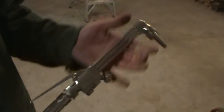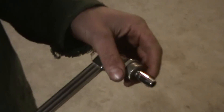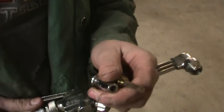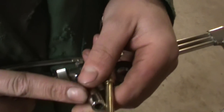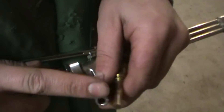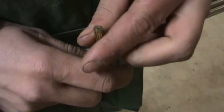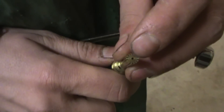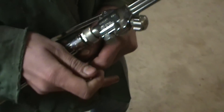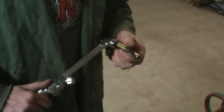On to the next difference: the torch body and everything's the same, however the tip is going to be different. And for those people who have used acetylene, they'll like this a lot better. As you can see, it's a two-part tip — we've got the inner part where the gas comes around, and then the outer part. Why is that better than acetylene? For the simple reason that when this gets dirty, I take it out, wipe it off, maybe use a tip cleaner on that one little port. That's it — it's good to go. That beats having seven or nine holes to clean out.